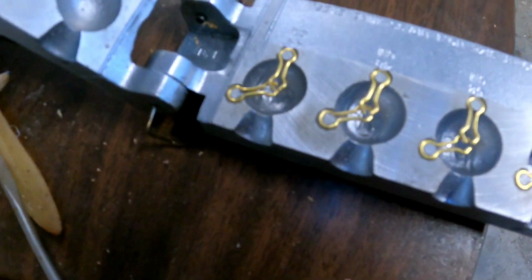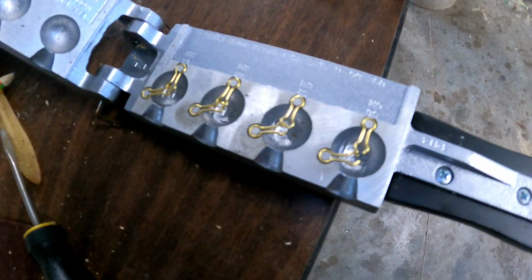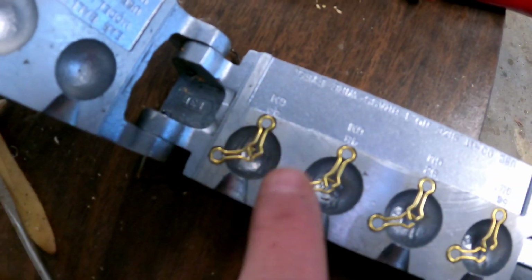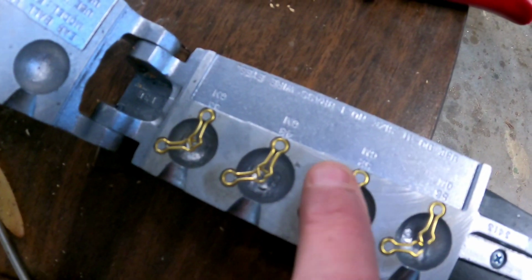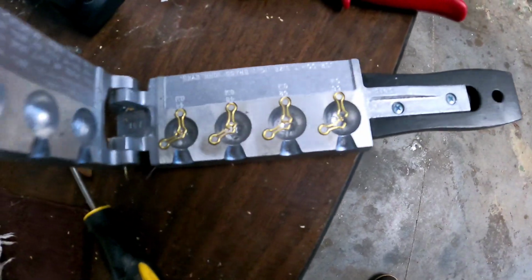This is a pretty cool round ball jig. Round ball weights you don't really see in the store a lot, but I like to use them a lot, especially for flounder and stuff like that for the Carolina rigs. And so you're going to preset your little eye loops into it before you pour it. And then we're going to close this puppy up as well, and that one's ready to go.